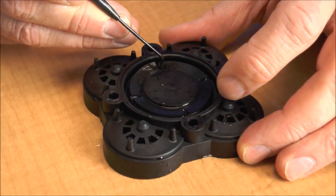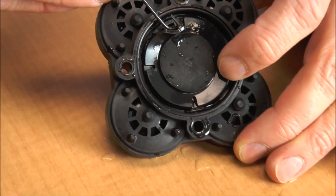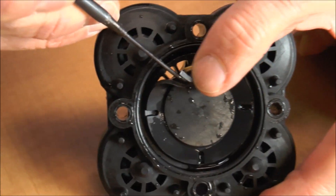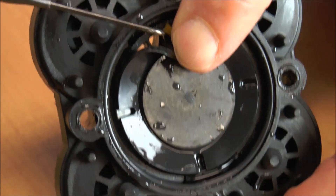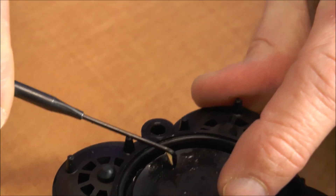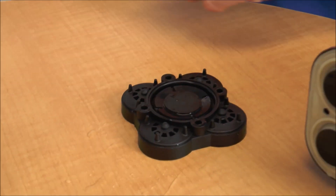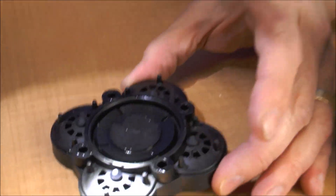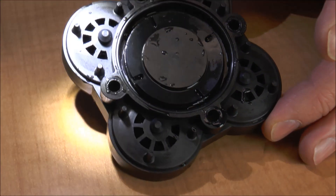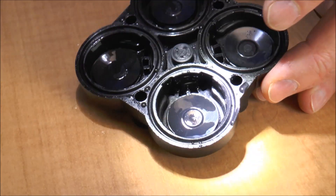Either wood or plastic. So what I'm going to do is pull that up a little bit. See right inside there — that piece of wood? There it is. Even the slightest bit of debris will cause the pump not to prime. So just for giggles, we'll take that flashlight, look in all the other valves, flip it over and check out these valves here. And it looks like we're good to go.